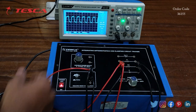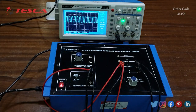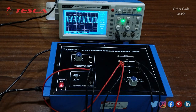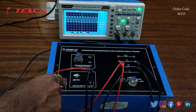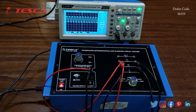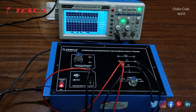That is how you can observe the changes in the waveform while changing the capacitor value, the resistance value, and the frequency. You can change the resistance to 1k or 10k and the capacitor to 470 pF, 0.01 microfarad, 0.047 microfarad, 0.1 microfarad, or 1 microfarad, and observe the output waveform on the DSO.